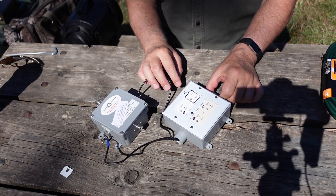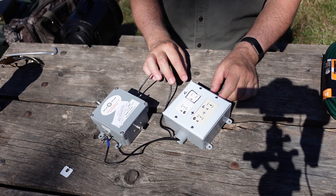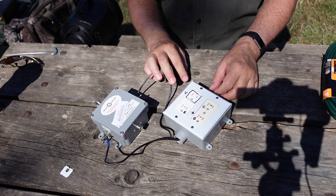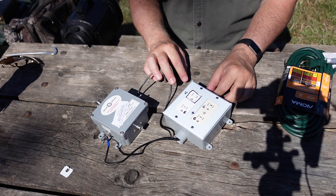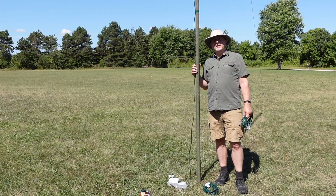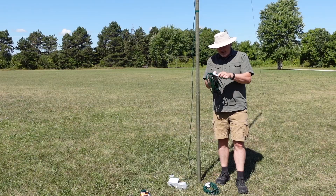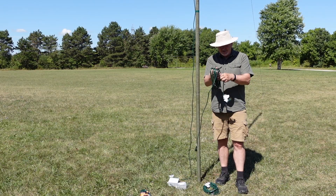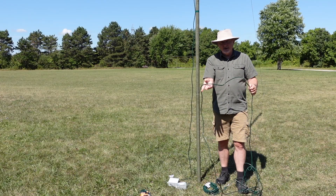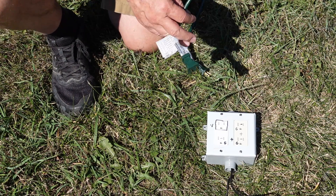So there's my Frankenstein monster device. I'm going to work with my pal Tom — there's a military mast set up behind me. I'm going to affix the vertical extension cord to it and then lay out the radials. We got the vertical element set up, the extension cord running down the pole. All I have to do now is take the remaining extension cords, set out the ground radials, plug those in, and then we'll look at the analyzer and see what results we get. Radials are laid, vertical is up — now to get these plugged in.